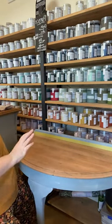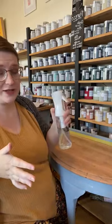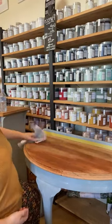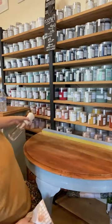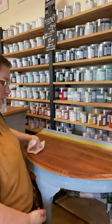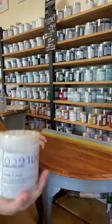The easiest way to see what colour your timber is — if you were to just wax or clear coat it — is to spritz it down with some water. You can see how it's quite red, quite pink. That's the easiest way to see what kind of colour you're going to be working with if you keep the timber with an oil or a clear wax. So I'm very gently going to spritz it down, and we're going to stain it with Pure Eco Stain and Glaze in the colour Whisper, which is the white. The Whisper is going to take out some of this red while still keeping it really quite nice and natural. Sometimes I go straight onto raw timber; other times I will slightly dampen it first. This just helps the Stain and Glaze move around a little bit.